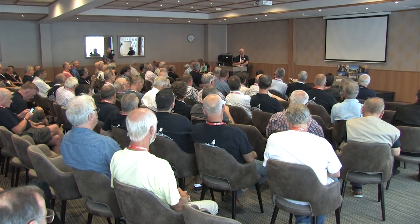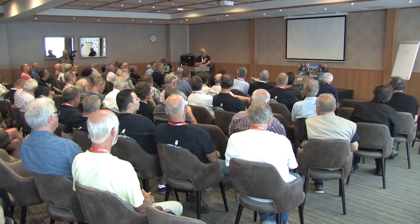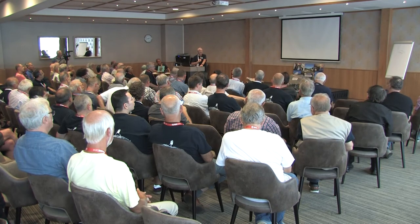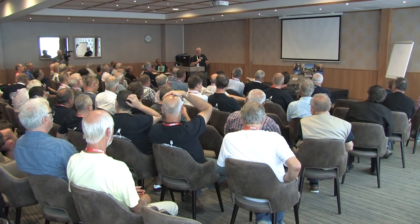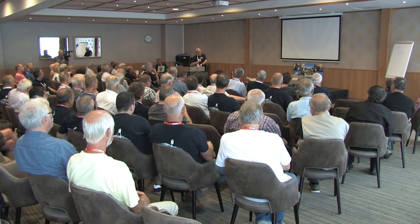For the 2 meter Anglian tests, I built a DC8RI. I built three of them. These are acknowledged as probably the best crystal oscillators that you or I could put together. They're not cheap to assemble because of the parts used inside them. GM3SEK had a batch of boards made. I made up several of those. Those are way down in the minus 160s, 170 dBc per hertz at 10 kHz offset. My tests on the Anglian were done using that and a 10-pole crystal notch filter to get the dynamic range. And I still didn't get low enough, but at that stage I thought, good enough.